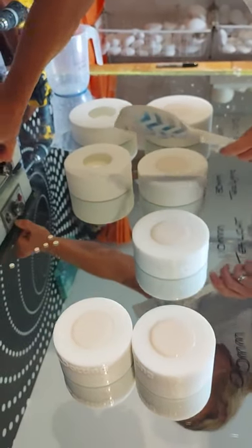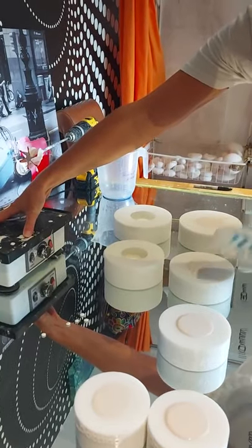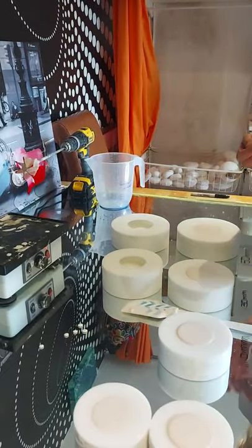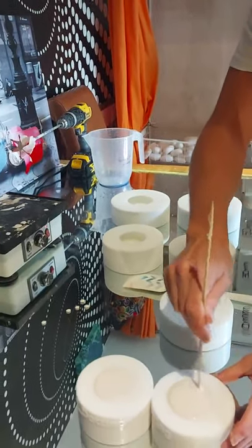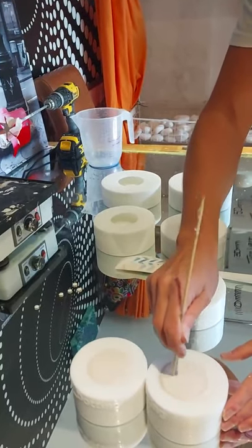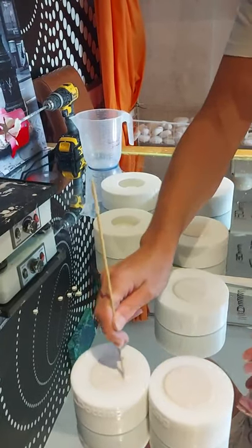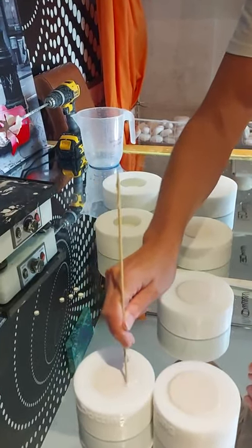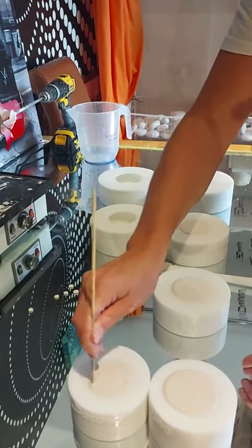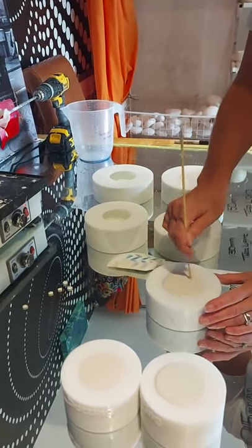Okay, I would normally use this, which is a dentist vibrating plate, when I'm doing a big pour. Basically, it just helps tap for me. The cocktail stick is to go around the inside of the mould, around the inside of the tea light, and that will just move any air that's lodged or stuck, which means that when your casting is removed from the mould, it won't have any holes or air pockets around the top. So we're going to do each and every single one.